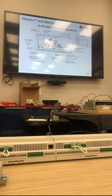If the IOM says 1.7, somebody made a typo and meant to say 0.17. Yeah, 0.17, 0.2, 0.25, even 0.3 you've heard from us. You've probably heard us come into your office and say it. 0.4 is what we're recommending now to keep proper flame because of the issues we're seeing, especially when you have 10 or 12 of these units on site. It causes a lot of problems when those don't all kick on at once.